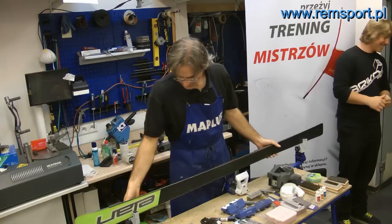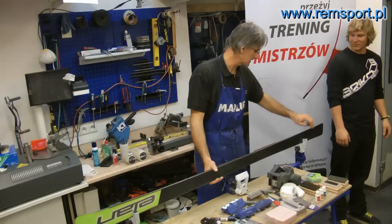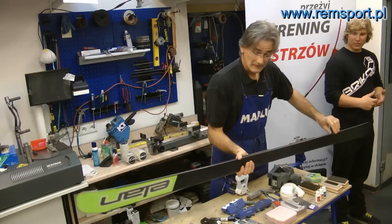If you work like that, it's a sharpened edge — it works. It's also without burr. Then we can polish it, and working with a diamond you can have a more sharpened edge. But this is what you have to use — working with the edge, you can have more sharpening with the diamond, but this is the base technique to master.